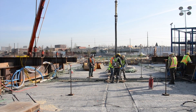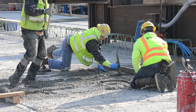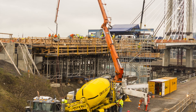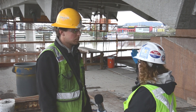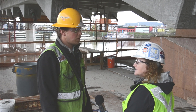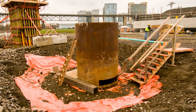We have two land side spans. The one on the west side is longer at 89 feet, and the one on the east side is a little bit shorter — it has the curve and it's about 69 feet. We have two land side piers besides our towers in the middle of the river, and they have two drilled shafts, correct? Correct — mono shafts into the column, about 120 feet down into the rock.